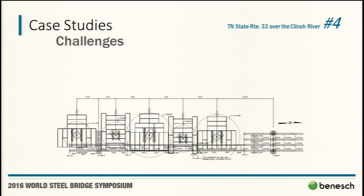The first thing they came up with was to use 3 cranes and kind of leapfrog them around and use 1 crane as a hold crane. And we told them all this would have to be done in a continuous work period. We had substantial production concerns. These girders, again, 8.5 or 9 feet tall, hundreds and hundreds of bolts in each of the splices. In the partial state, we weren't really able to reduce the number of bolts required as much as they would need to get it erected. But they said they're going to get started, assess their production rates, and then come back and revisit this.